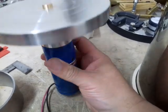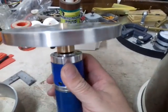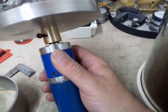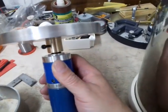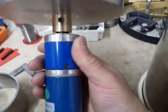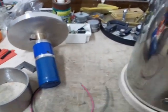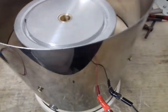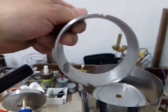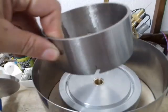The motor inside here is one of these and you can see the layout of the spinning plate itself. They're both I think 5 eighths thick and then I've got the brass insert in the centre which is pressed in. This one's actually for a slow speed grinder which I'll come to later on. The actual centrifugal machine now has got its spinning disc in, and then I've made a flask from 2mm wall 4 inch diameter stainless steel which fits into that little groove.